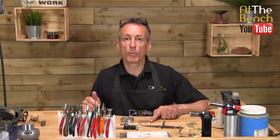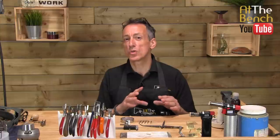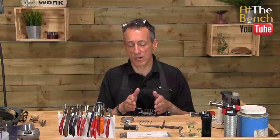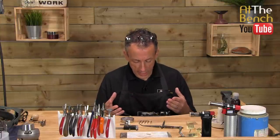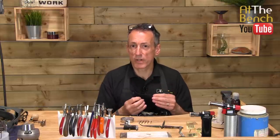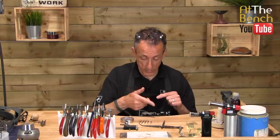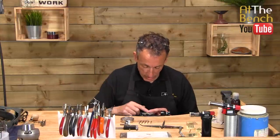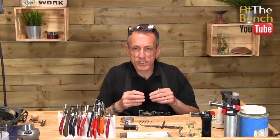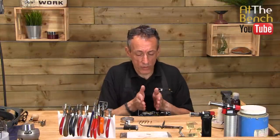Here I've got a 0.9mm drill and a 1.5mm drill. So why do I use two different size drills? Say you have a plate and you have to drill a few holes and they all have to be even. If you drill a hole of virtually the right size for the stone, in where you put the mark from your scribe or centerpunch or graver, and the hole isn't quite right, you've had it.